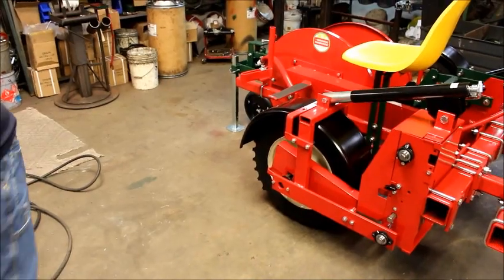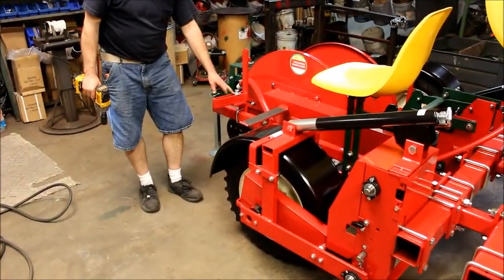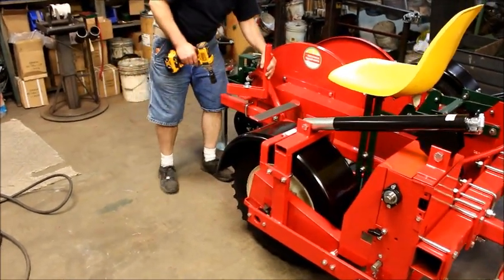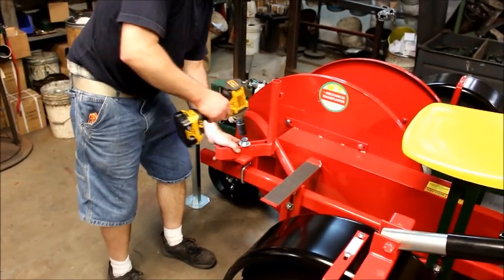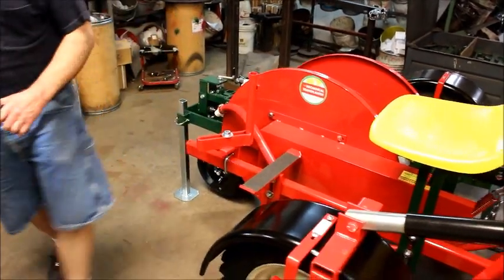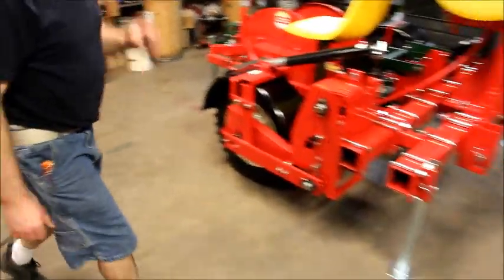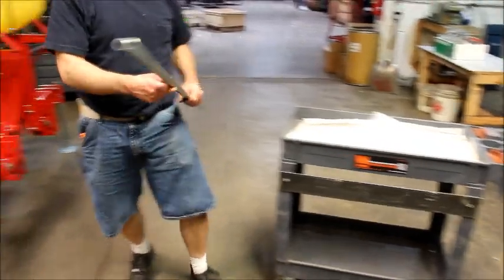Okay. And what I put this on with was a 5/8 by 3.5 bolt, with a flat washer and lock washer between. Again, this can be moved however to make it easy for the operator. Now we're just going to set it there, and we'll do a final adjustment after we can set the rider on it. The next thing we're going to install is your carousel pipe.